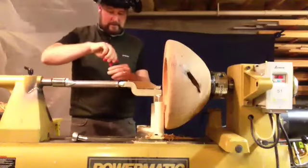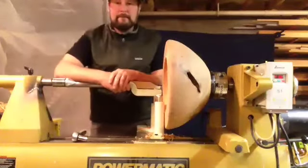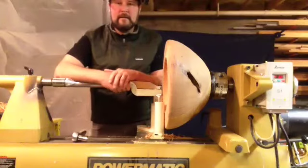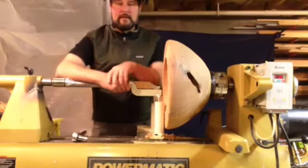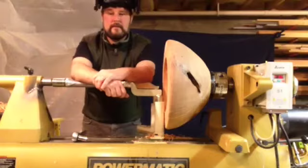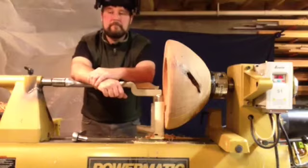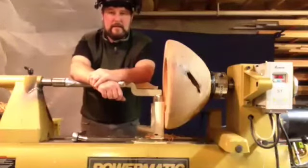I'm going to chime in again. I've found that PVA glue, which is basically regular school glue, Elmer's glue, works marvelous as a coating. As Jim saw at the house last weekend, I have extremely good success with not getting checks and cracks. I coat the entire outside of the bowl and the end grain on the inside of the bowl. It may take a little longer to dry, but I've had very good success. I actually found a place I can get it for $5 a gallon. It's PVA glue, polyvinyl acetate, and regular Elmer's glue works marvelous.